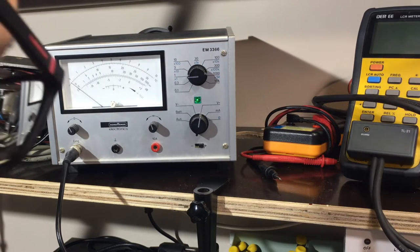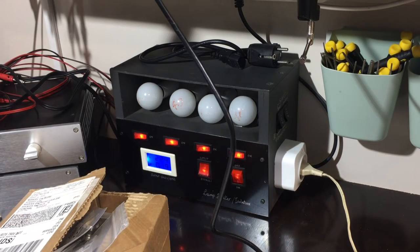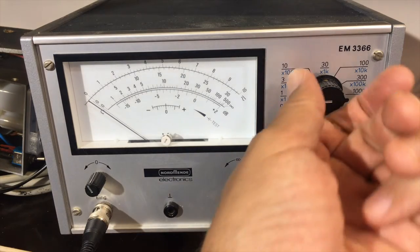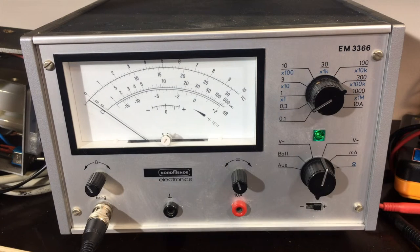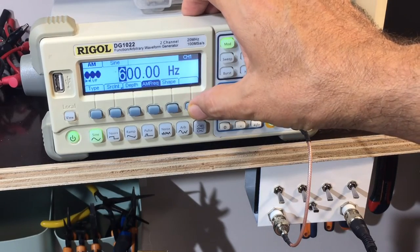I'm going to switch on the power. I've got minimum limiter on here, so all the light bulbs are in parallel over there. Restriction is still on but it's on minimum. And I can hear the crackle — I've got the volume on max, I can hear the crackle from the speaker over there. But we're still reading nothing on the meter. I'm going to activate the signal generator. Signal generator is on. Everything seems to be fine. 460 kHz.